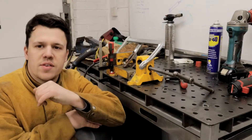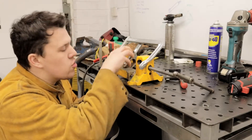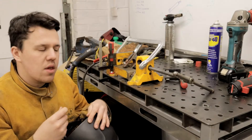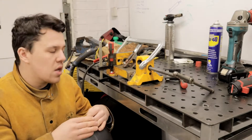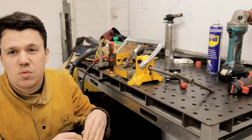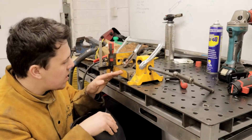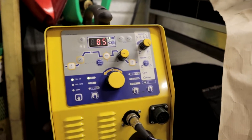You can see we've just tacked the vise in place — a tack each side. Before that I preheated this area as much as I could, because when it's cooling down after welding you don't want it cracking again. It's very common when welding cast iron — you think you've got a solid weld and then as it cools it cracks off. You really want to slow down that cooling cycle. I'm using a phosphor bronze filler rod, 1.2mm. The crack isn't massive so I haven't gone crazy — I want to keep it as neat as possible. We're welding on 85 amps, straight DC current.